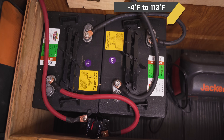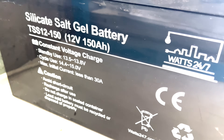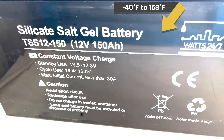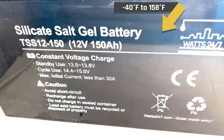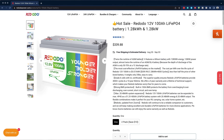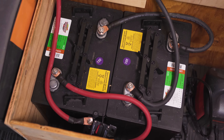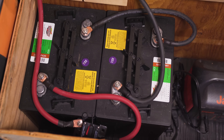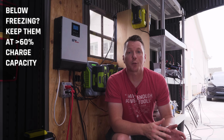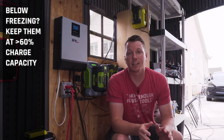If you need something with a more extreme temperature range, you can look at silicate salt gel batteries, which can go much colder and warmer. But if temperature range isn't as important as size or weight, then lithium or LiFePO4 batteries are a great option too. In my case, I found that these two six-volt flooded batteries are enough to power everything I use here with no issues. With flooded batteries, when it gets below freezing, make sure you're not draining them below about 60%.